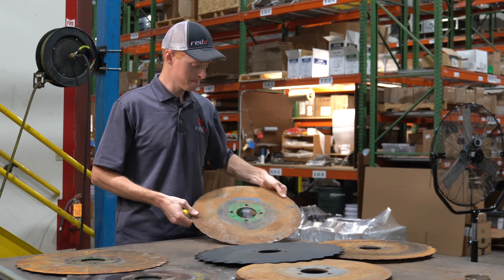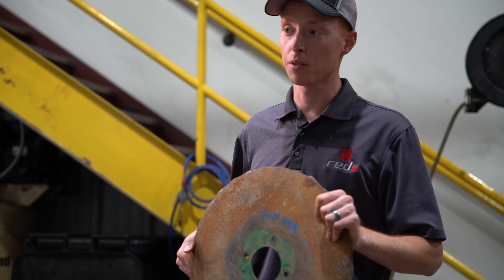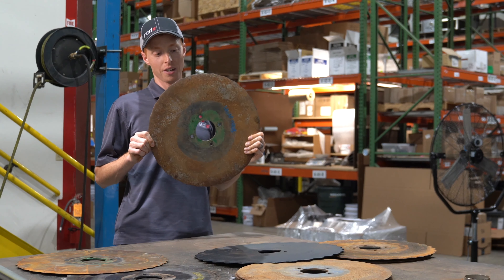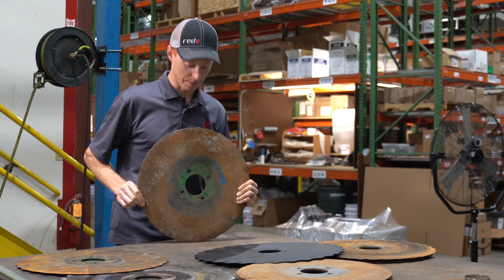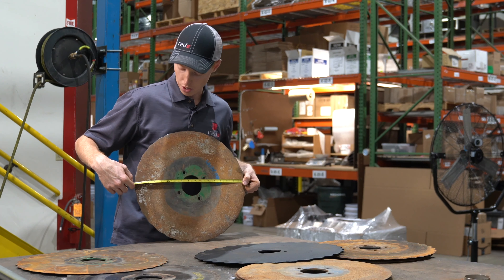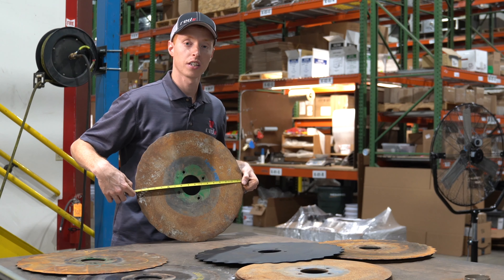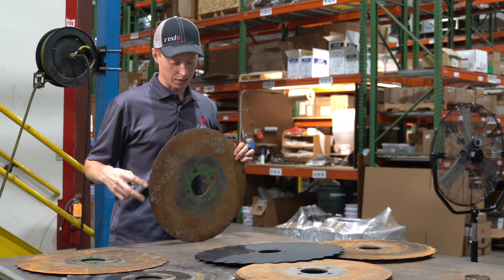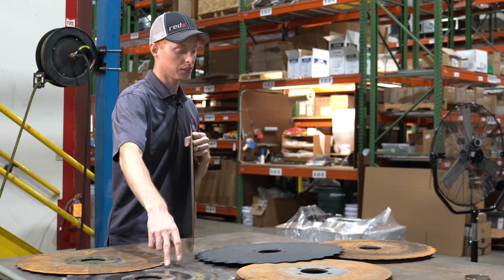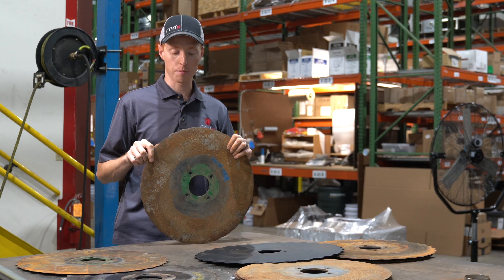Not enough evidence? This one we had up in Alberta was 8,000 acres. This is an applicator who runs whenever it's not frozen. You may not even be able to see it's a 30-point disc, but they're there — they're just about worn off though. So what happened after 8,000 acres in no-till conditions in southern Alberta? We're at just under 17 inches, about 16 and 3/4 inches at 8,000 acres. The disc is exhibiting being more dull than it was at the 5,000 acre mark, but clearly this is a disc that you'd want to change anyway. It did a very good job throughout its entire life.